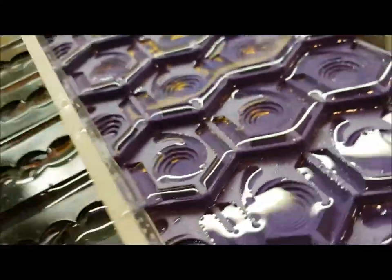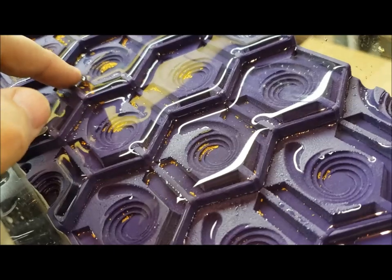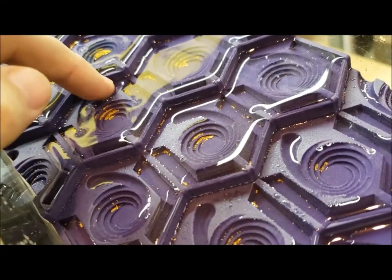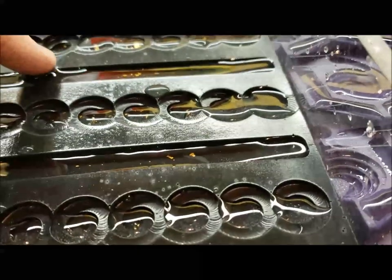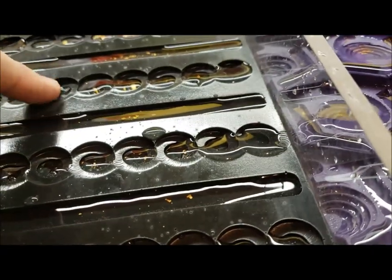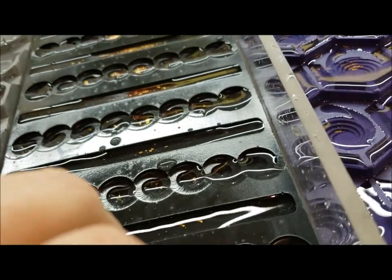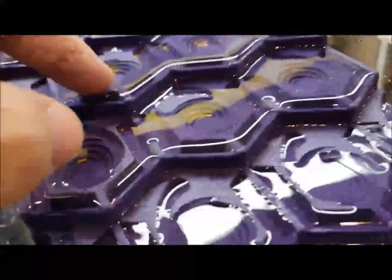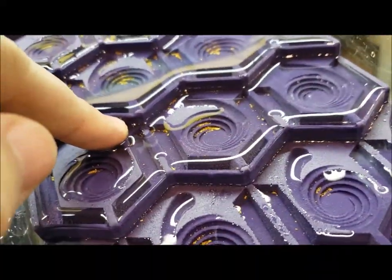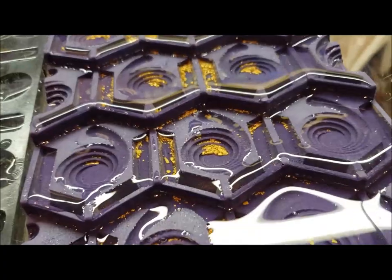This mat was supposed to have a drop riffle in the shape of his logo, and a vortex in it. So it had all three. Instead, this one just has a vortex, well, some would argue this vortex. This profile has a drop riffle here and this drop riffle, and that's it. So we basically had two drop riffles. This here has the hydrocyclone profile, and so does this. But this has a drop and a vortex and a drop riffle, just a different shape. And you can see how it did.